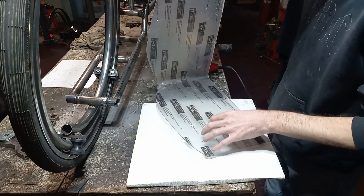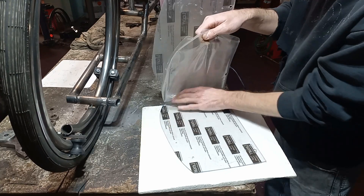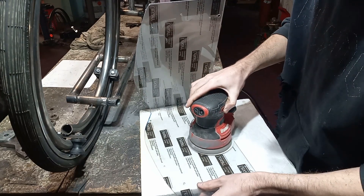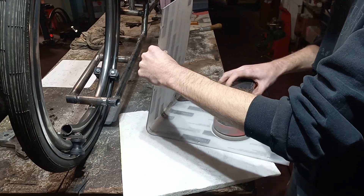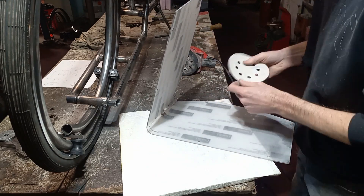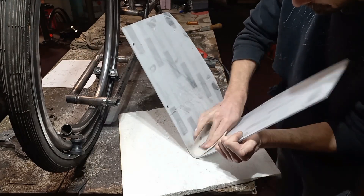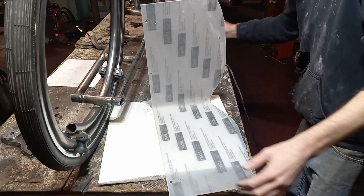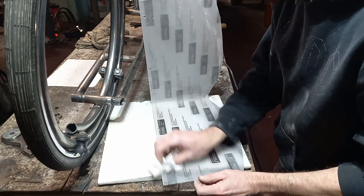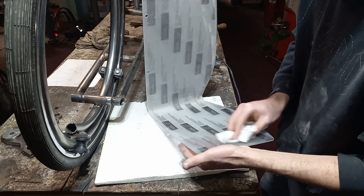So to frost the Plexi, we just want to do the inside. We're going to pull off the protective film, and I just have 220 grit on here, so we'll start with that and see what it looks like. The center section I can't get at with the sander, so I've got to do it by hand. Alright, so we're done sanding. A little bit of plastic cleaner around here, and while it's wet it'll make it look pretty transparent, but as soon as it dries that fog will come back.